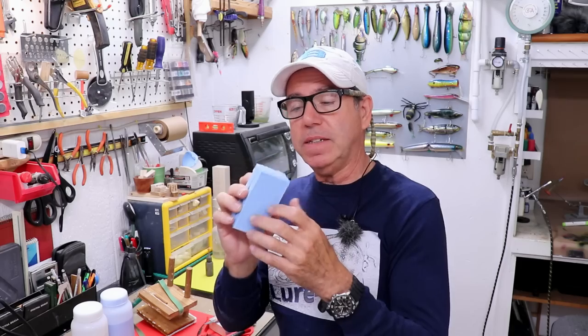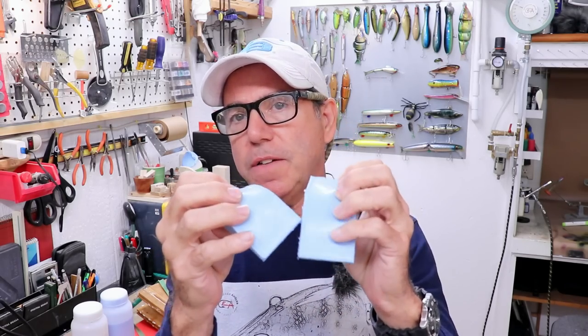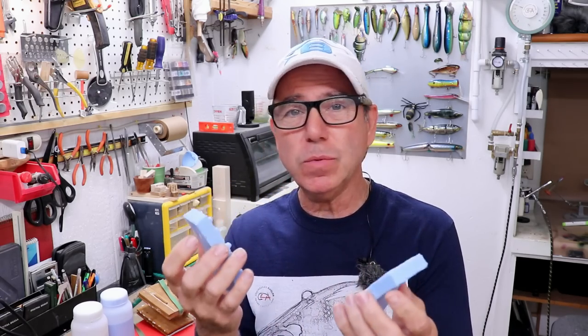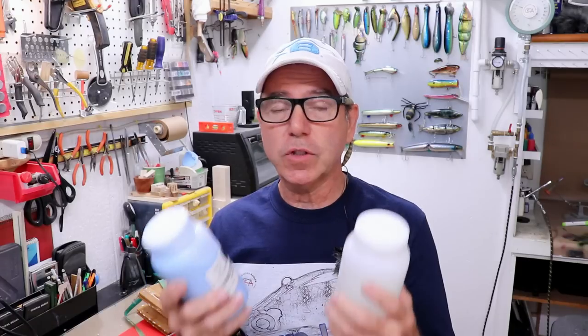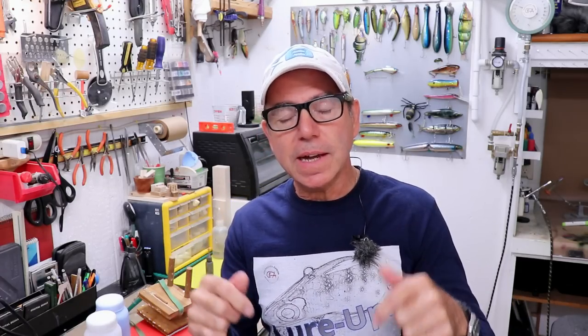After cleaning off the sprue and flash, we have a nice, well-formed casting with a good rattle in it. I need to make about nine more of these. The silicone turned out to be a good deal - it is a little on the soft side, and for a two-part mold I'd normally prefer it slightly stiffer, but this will do just fine especially at this price point. Fourteen dollars for nearly two and a half pounds is a little better than half the price of most comparable products. I'll put a link in the Amazon store. Give a like, subscribe, and submit your questions for the question of the week in the comments. See you next Friday.